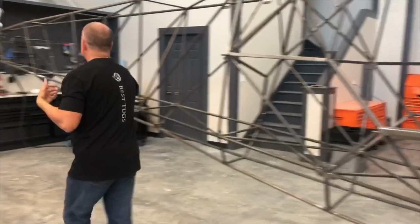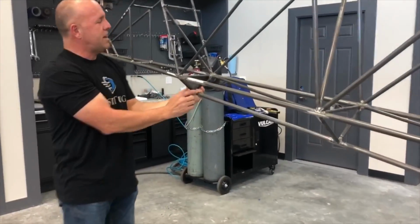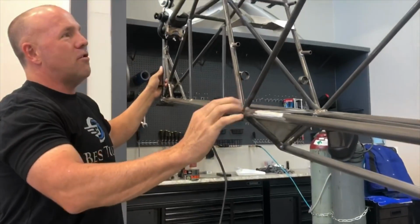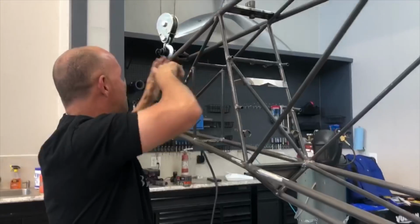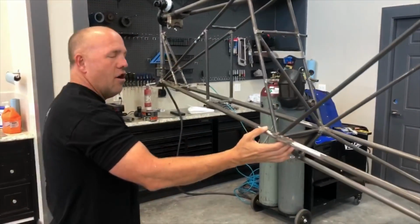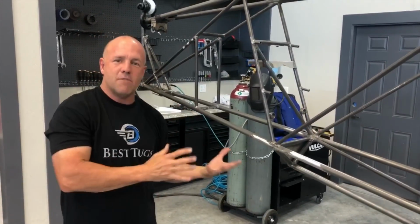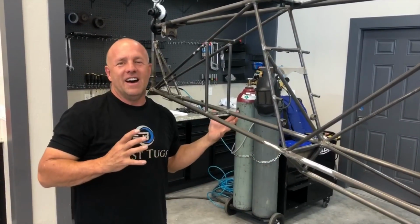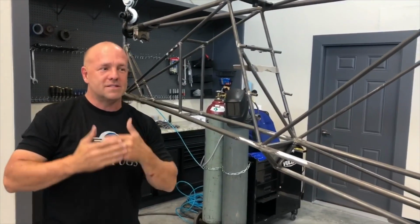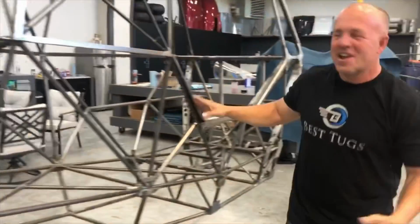a little bit more. Back here, I ended my reinforcement at this point, and so here I really do need a lot more. So I'm gonna web this out with a few more braces, but at this point I'm attaching a very long travel tail wheel assembly. So I'm putting in a great big monster shock, and I'm gonna make sure that this thing can really handle a lot of weight on the tail, because I'm spreading the wheels far apart for stability and for all the other reasons. We're getting close.